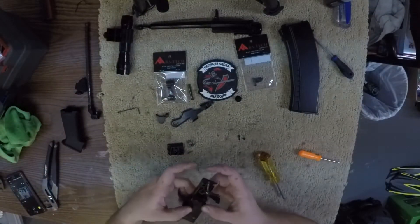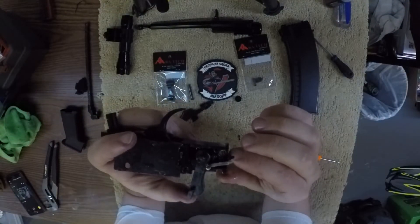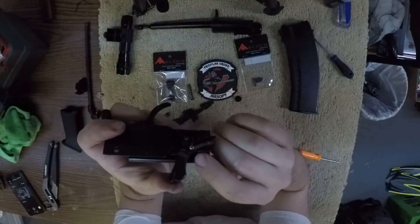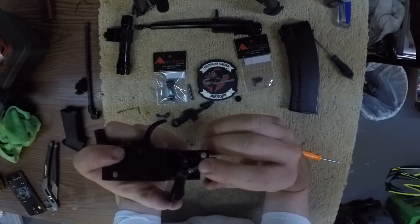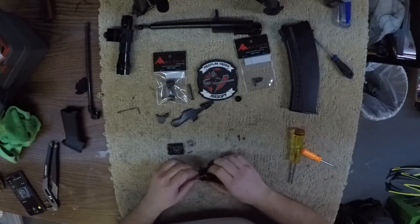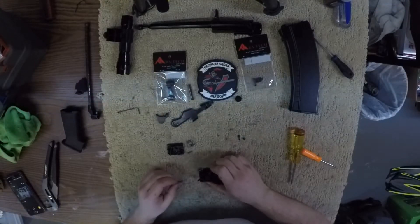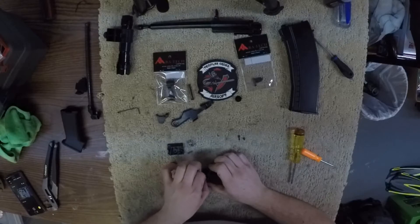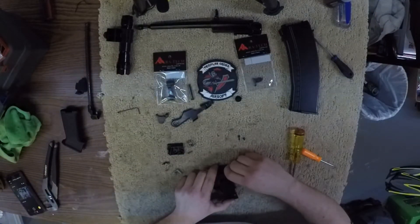Now, as you can see in here — and you're going to have to remember this for when you put it back together — there is a spring in front of the firing pin itself. It sits in there, goes in front of the pin into that little hole, and comes back up. You can kind of see how that functions. What we're going to do is take these parts out. Grab the firing pin and pull it straight out, be wary of the spring attached to it. There's a plastic piece in front of it — you can take that out as well. Now you can pull the hammer off itself.